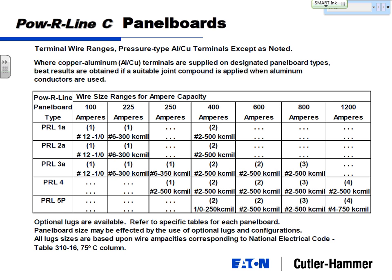Everybody here knows the NEC, I don't know if you've gotten an NEC yet, but there's a cable sizing chart in there, and the cable sizing chart has different temperature ratings, and you've got a middle rating that's 75 degrees C, and I think that's a general column that most of the contractors and the engineers follow. As a manufacturer, I can't emphasize enough, you have to use the middle 75 degrees C column. All of the lugs on all these circuit breakers and all the panel boards and all the switchboards, everything is sized to the 75 degree C ampacity column. So even if you have 90 degree C cable, you have to go across to figure out the ampacity for the 75 degree C column. Don't even ask, because you can't get around it.